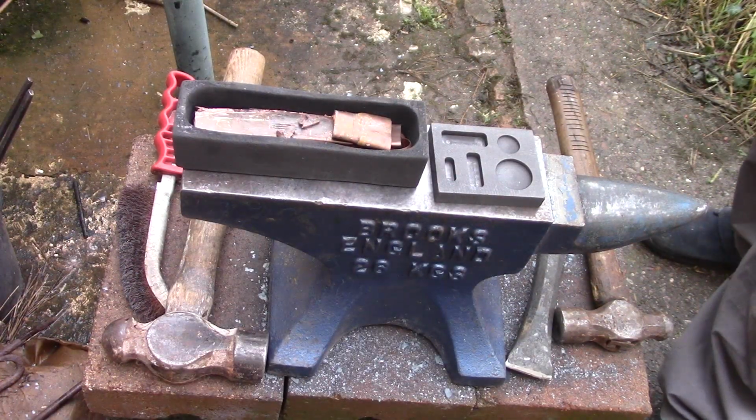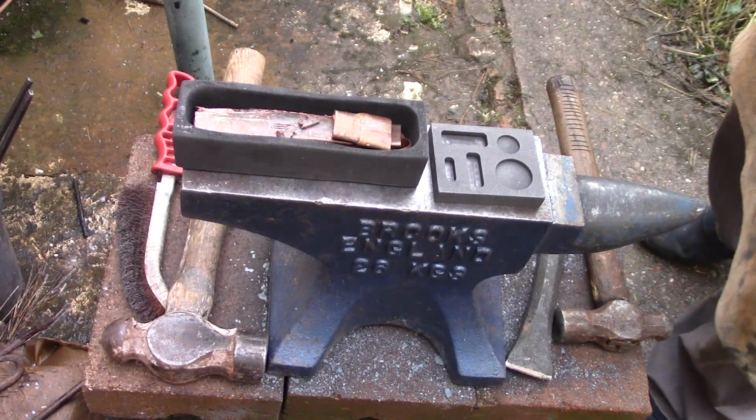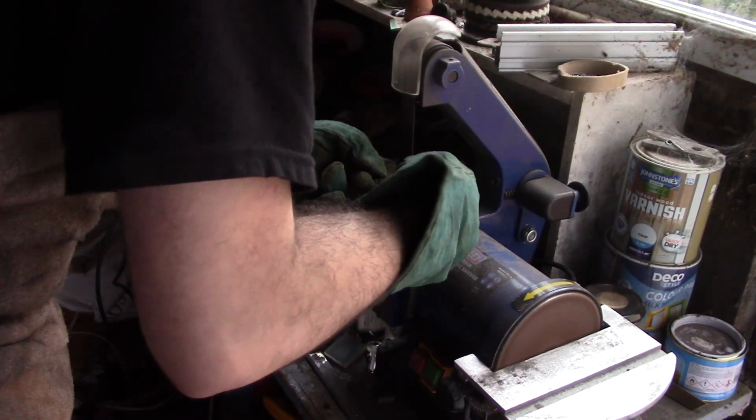I used a mould that I got for Christmas to cast it, and basically I took it to the grinder. I used the bench grinder and a belt sander to remove some material, and I found that it was very difficult to hold on to. Using my gloves, it was almost impossible to hold on to properly, and even using very grippy pliers, it was still tough to hold on to, and I don't know if I caught it on camera, but it actually ended up coming out of my hands and getting under and into the grinding wheel, which could have been dangerous, so I immediately switched the tool off